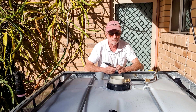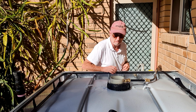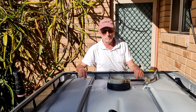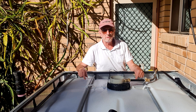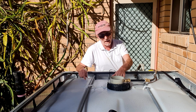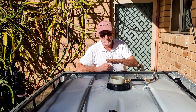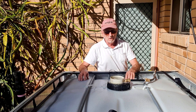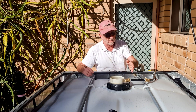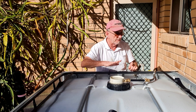The ultimate test is whether the liquid level is going down — if it is, you're going to have a leak. Bear in mind that the air going in is probably not the same temperature as the water, so it's probably going to expand or contract a bit when it first goes in, so that water level may go up and down in the first half hour or so. It's gone down a little bit now — give it time for the temperature to equilibrate. Once it appears stable, watch it for a few hours and see if it's going down. We're only testing as far as this tap, but so far it's looking good — I haven't seen any leakage.